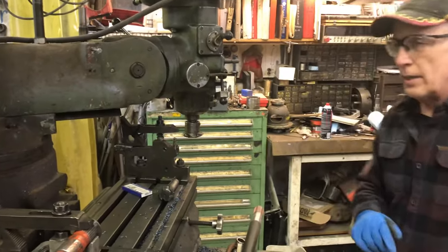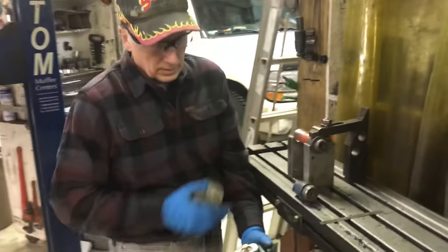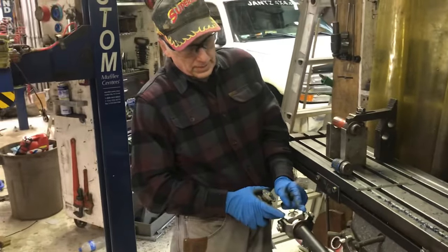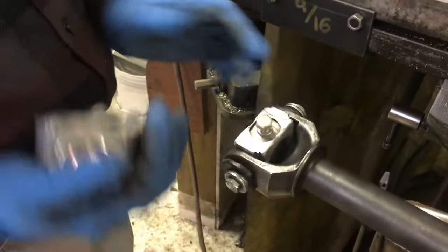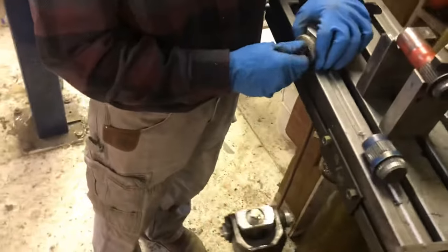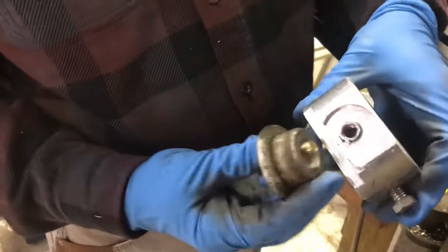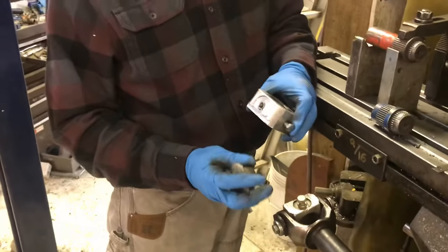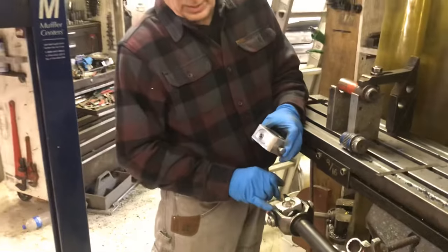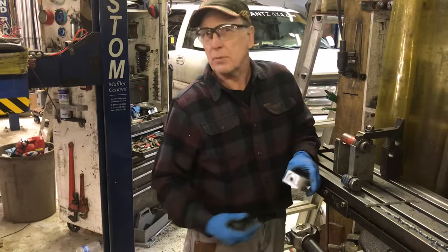Let's see how the indexing system works again. I made these little blocks about 20 years ago, and they fit right inside between the yokes. The plastic little pieces actually fit and lock in a little recess. It actually works better to have a plastic flange on there, because sometimes different stock ones and aftermarket ones have different thicknesses, but the plastic gives some give when you suck it all together.